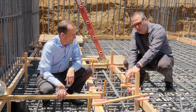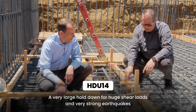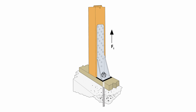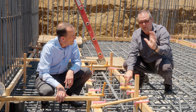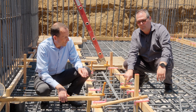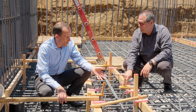So these are HDU-14s that we've got here. It's a one inch all-thread that goes down to a washer on the bottom that holds it in the concrete for embedment. This will go from here, up to the next floor. There'll be a floor-to-floor connection where another HD connector will be. It'll go all the way up to the third floor and to the roof, so this wall is designed to be a big giant shear wall inside of the house. Because we took the steel out, we required these really, really strong shear walls.